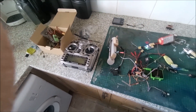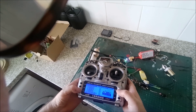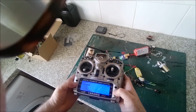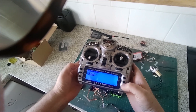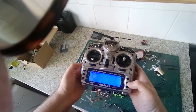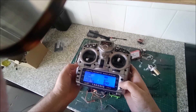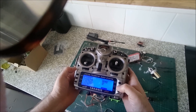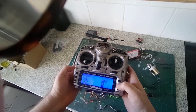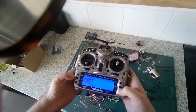I've been through the channel mapping. You can't do any channel mapping on the transmitter side, but you can on the receiver. You go in, hold that down, go to next page, go to Crossfire, go to the Lua script and execute. Nothing to change on the transmitter side. I've been all the way through this receiver and I did get it to couple up with something else, but there's no way to split the signal - you just get a duplicate of say the rudder channel. So you get a rudder movement on both - it's just impossible. I've tried channel mapping and everything and I keep getting a syntax error. I've given up with it.